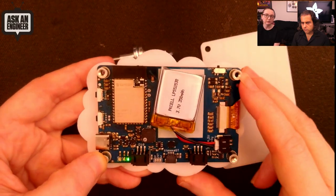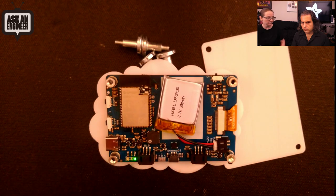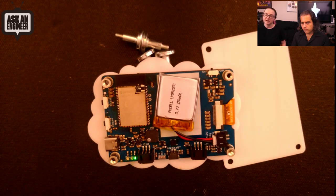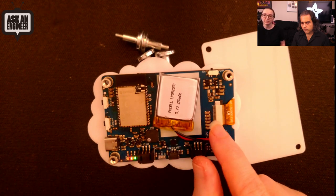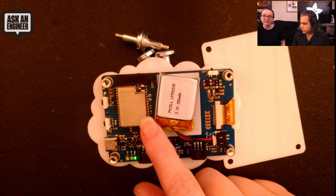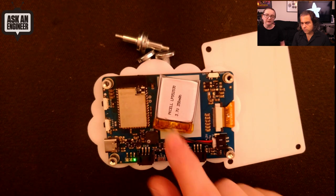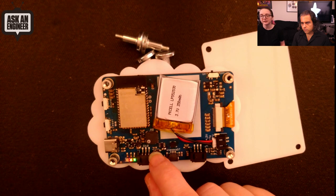And then maybe soon we'll do a couple of videos. I've been doing low power improvements on this, and also testing out deep sleep on the ESP32-S2. So I got this whole thing down to about 250 microamps. I think considering all the extra stuff that's on here, I don't know if I can go lower. I'm going to try to see what is taking up the current, because for this ESP32-S2 there are no published numbers, but for the ESP32, it's down to like 50 microamps. So there's 200 microamps here maybe I can get rid of.